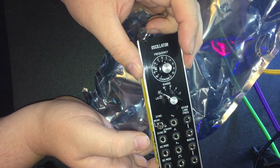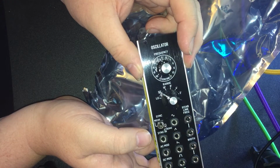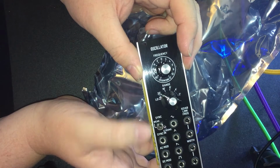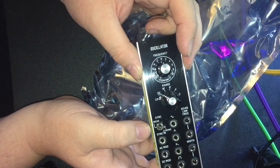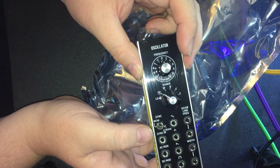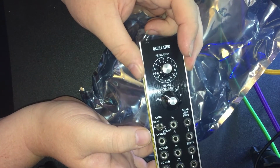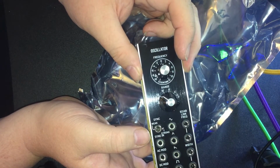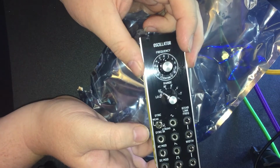I'll do a video on it. But anyway, going back to this, I was reading up on the sync on this. Whereas the 921 actually does what the normal kind of hard sync that we expect from synths these days, the type of sync on these only has a certain frequency range that it works in. Beyond that, it doesn't work. So those kind of enveloped pitch, for want of a better word, effects that are associated with hard sync and lead sounds, you can't do on this.